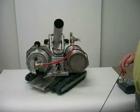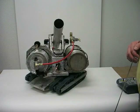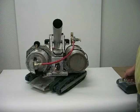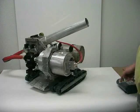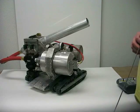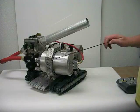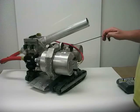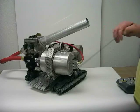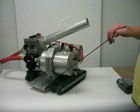A quarter-inch high-pressure air hose runs to an industrial pneumatic valve, which releases the pressure into the accumulator tank. The accumulator tank is 400 cubic inches, with a quarter-inch wall thickness, all made out of 6061 aluminum — very strong, all nicely welded. Here is the pressure-release valve, which exhausts any excess pressure into the atmosphere and releases at 150 PSI.